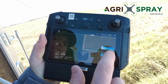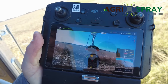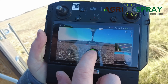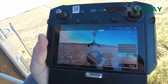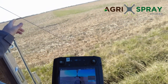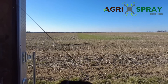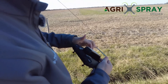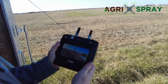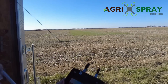You can see the drone detecting a fence — it's detecting that pole on the side. It knew it wasn't close enough to stop, shown in yellow. If it got too close, that would turn red and it would stop itself. Obstacle avoidance is very good on the T30 and the range is also very good — we're actually flying about a half mile out right now. You can see the drone against the tree line. If we fold the antennas up, we get even better connection. Flying half-mile-long rows in corn — no big deal.